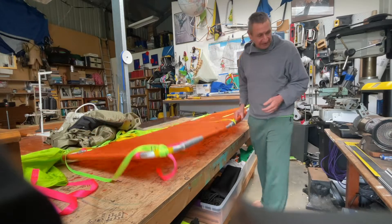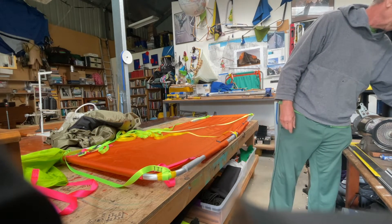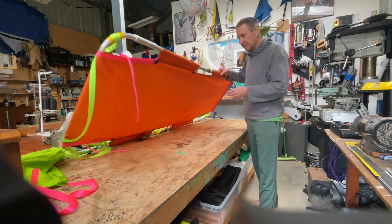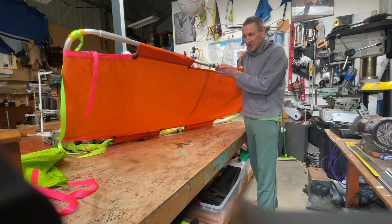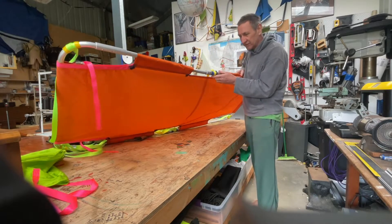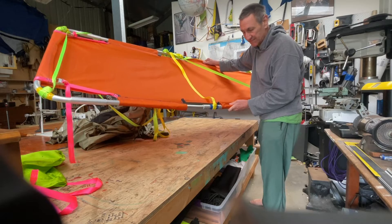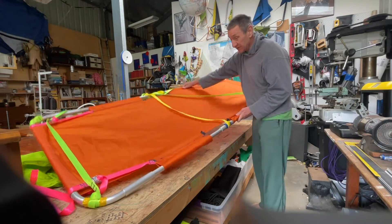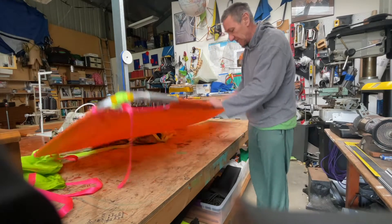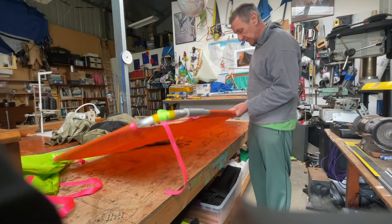I gave this a pretty aggressive test, and there is a bend in this 6060 T5 aluminum. In some ways it's better than the higher strength aluminum because the material deforms and can be unbent with a bender pretty quickly and easily.